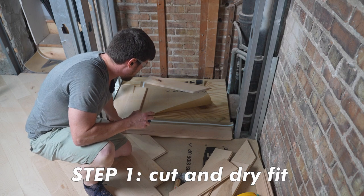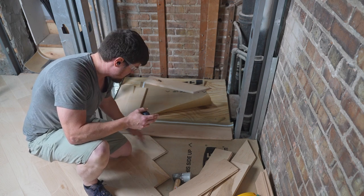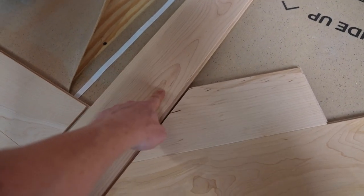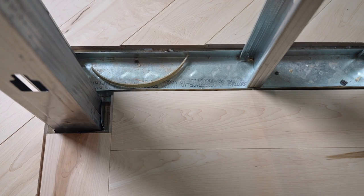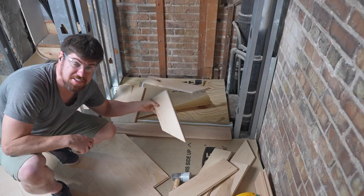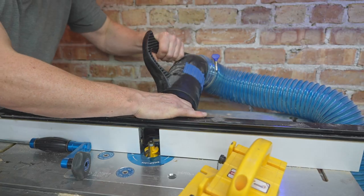The first thing I've done is cut a transition board that's going to sit in the doorway between the main living area and the closet. I've also cut some 45-degree ends on a couple of pieces. I want these boards at 45 degrees lining up with the threshold, and then the boards going in straight on the other side. Since walls aren't parallel, you have to make sure they don't go off at too much of an angle — otherwise you end up with a funky gap at the walls. These angular pieces don't have the groove where they need to sit in the tongue of the threshold piece, so I'll head to the router table to cut out the groove.